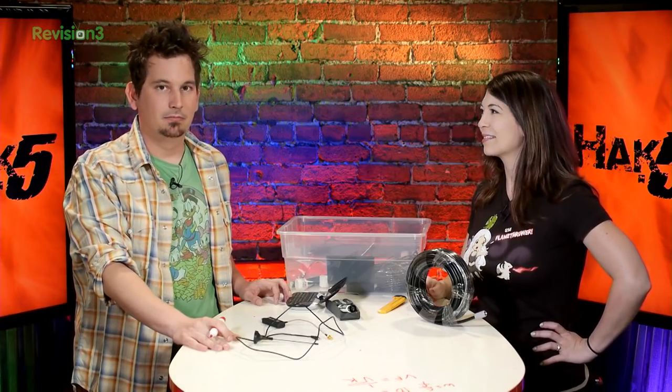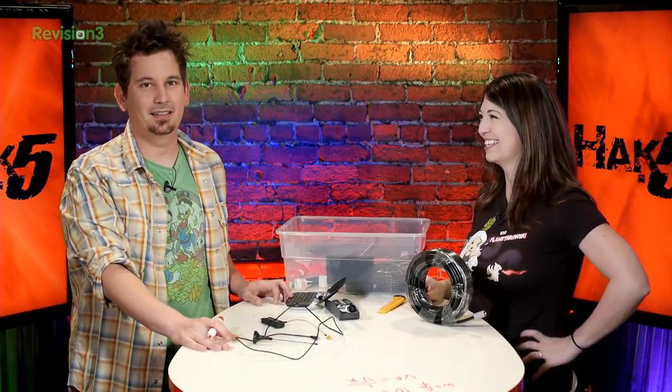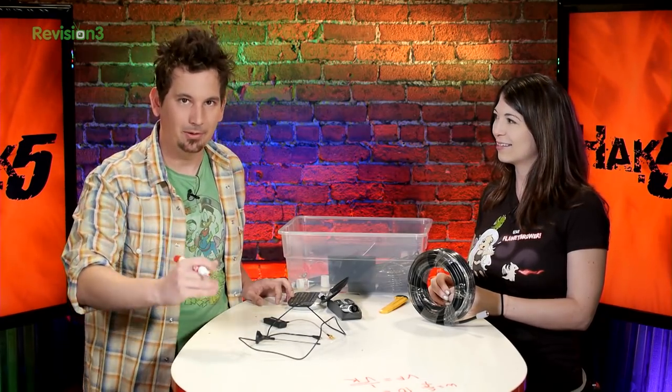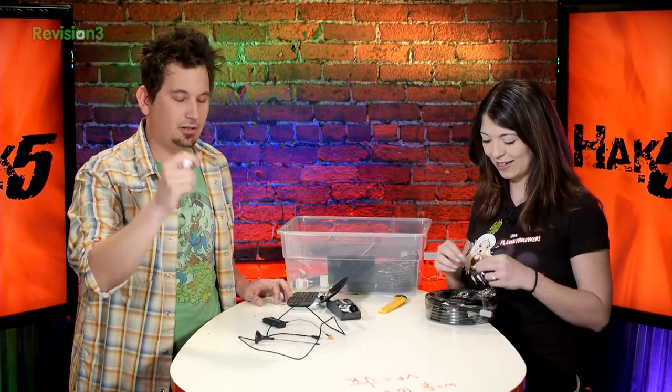But anyway, to cut to the chase, you asked me how do I find out the velocity factor of our cable? Well, Google it. The cable manufacturer made the cable, they know what it is, and they're going to list it. They're going to call it the velocity of propagation, or the VOP. Just look on the label, it's going to say what it is.